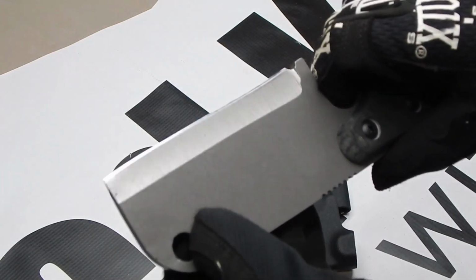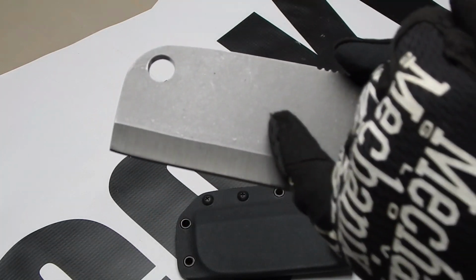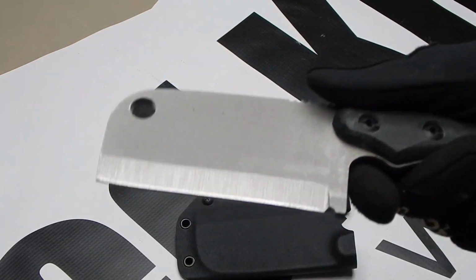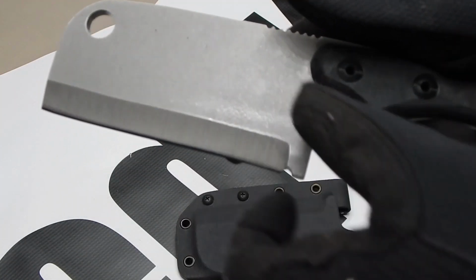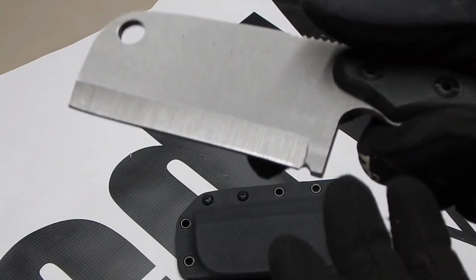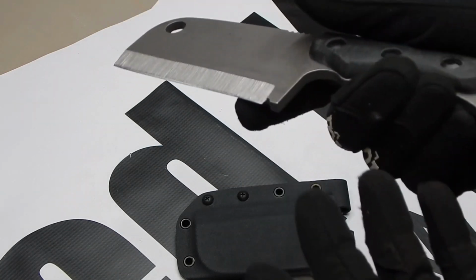Very sharp edge. Alright, so next up, let's talk about the blade here. I have a hollow grind blade, but it's kind of like a Scandi grind, to be honest. Usually hollow grinds go very high up the blade. For large knives like this, they go quite high. Or with a blade this size, you'd have a flat grind. Well, how my machines are set up, they're hollow grinders.